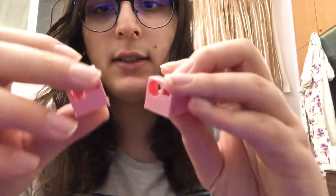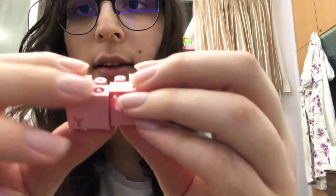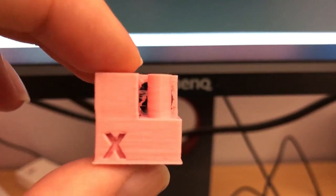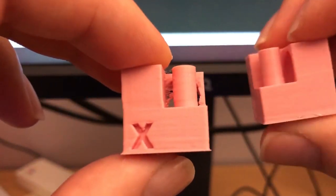To test it, I first printed a few cubes. I started with the 0.4mm nozzle to see the more everyday common usage. The Volcano is obviously better for bigger nozzles, but the main question is: does it pose any disadvantages for everyday prints? As you can see, while the prints look similar overall, the Volcano print has massively more stringing than the one printed with the V6.